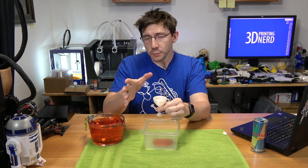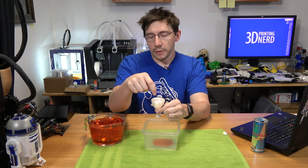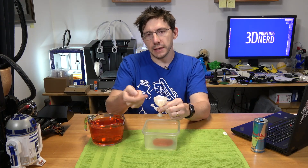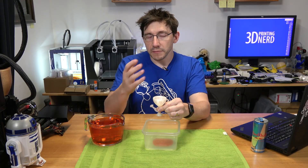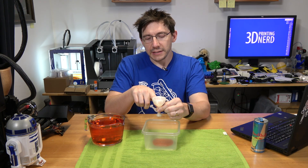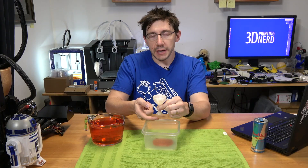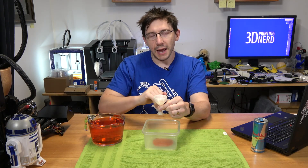So how this works is actually fairly simple. You've got a water level that rises within the main cup itself, but there's also a pipe on the outside of the inside of the cup — but inside the outside of the cup — that rises at the same time because of Pascal's principle of communicating vessels. Once the water level inside the cup is higher than the tube that can circulate and drain it down, the water actually starts siphoning out.